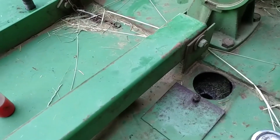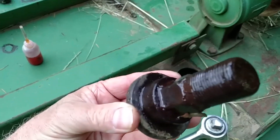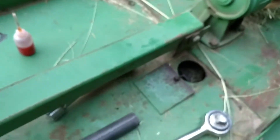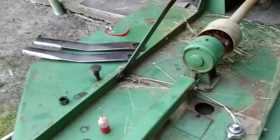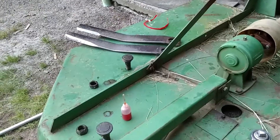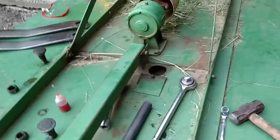Of course there'll be a post on it, but I've already taken these apart. It's important to know that the way these things are constructed, if you look carefully, you'll see there's a hexagon shape at the base of this bolt pin. That means it'll stay in place while you loosen it, without having to reach underneath and have somebody hold the bolt while you wrench on the nut with a socket. Pretty ingenious design — kudos to the John Deere engineers who thought of that.